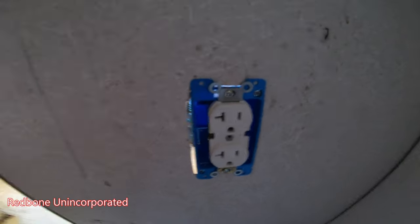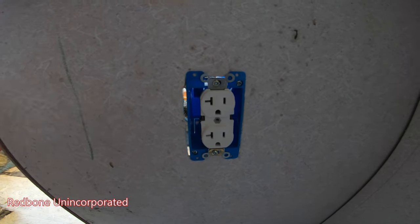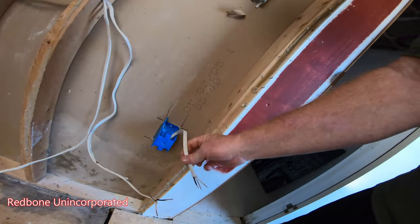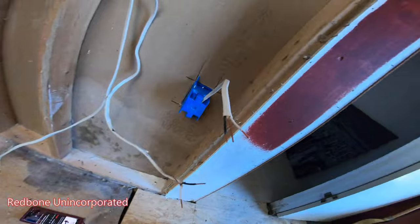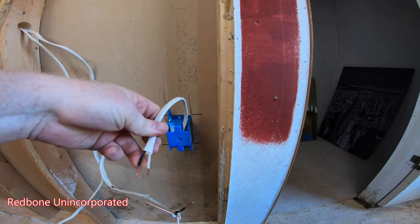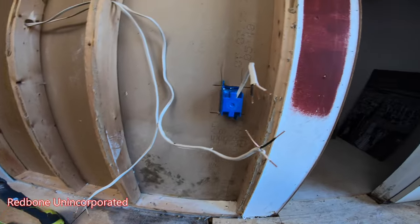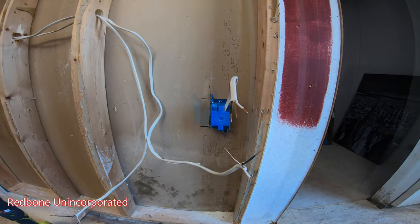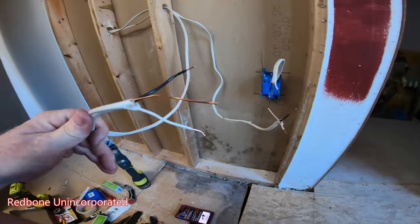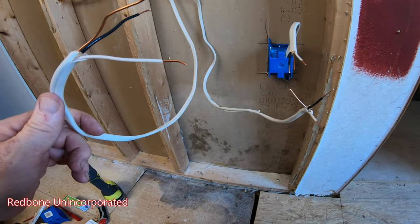Okay. I didn't include you in this, because there's no light in here, and there's no room for you to see. The wall box is in, got this wired up. Just gotta put the faceplate on. And I got just this one piece of Romex coming out, and I should be able to tie that into my hot right there. That should be golden. That should be all I need. Well, I have to sacrifice a piece of this to pigtail this one and this one. You'll see.